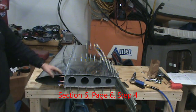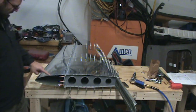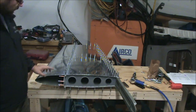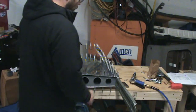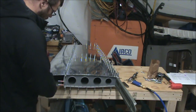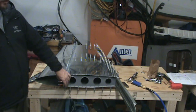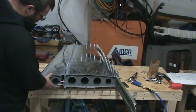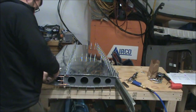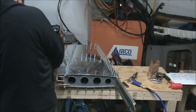Next step is to reinstall the nose rib down here and then rivet it into place, making sure not to install rivets in the holes that you didn't dimple, obviously. Remember, the only reason I have clecos down here is to hold this doubler on, which will be getting installed later. Since you can't rivet those holes, they are good candidates in my mind for clecos.